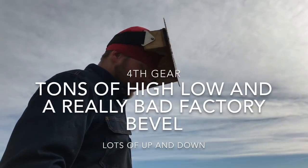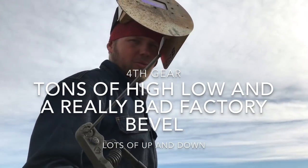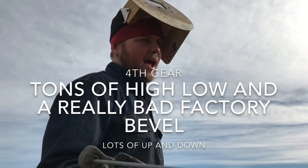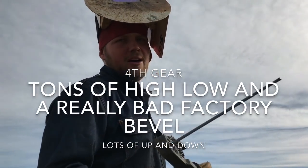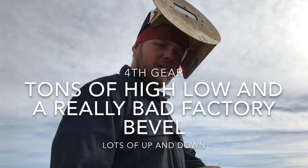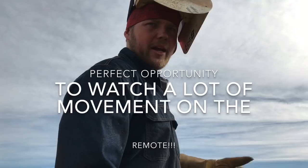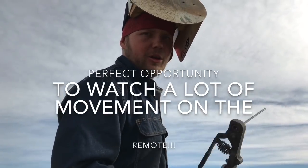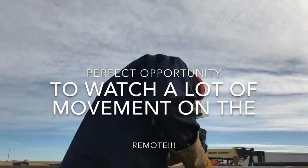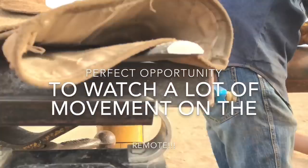We're getting ready to run the root in here really fast. Usually, for all you helpers just starting out, your welder is going to have a heat that he wants to be on. Right now we're starting on 30, we're going to go from there. We're in fourth gear, and Jed's going to explain the up and down — each welder has their own preference on how much they want you to go down or up. 30, you are on 30.